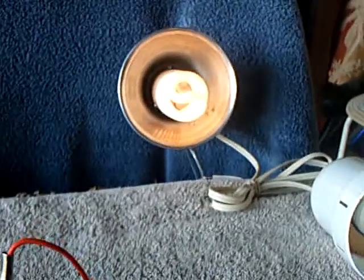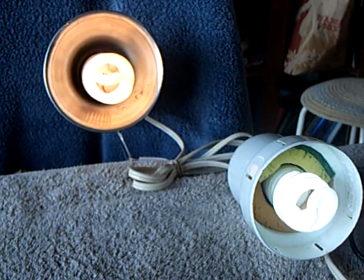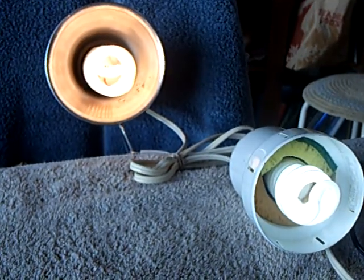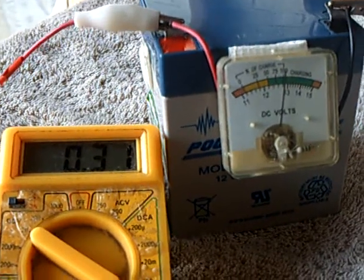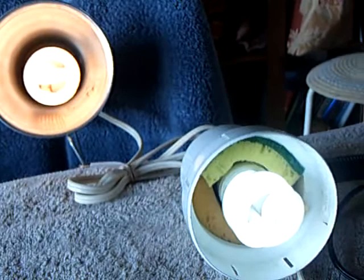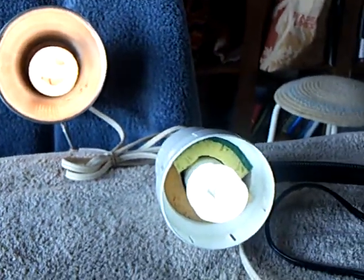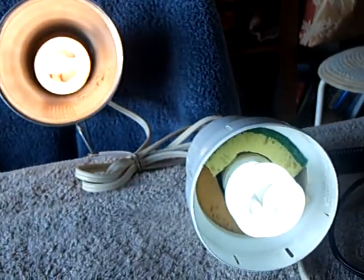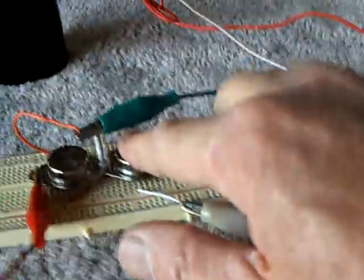I can dial this up and increase the brightness slowly — if it stops you have to jump-start it again. My target is about 300 milliamps, which is what I draw on my standard 12-volt fluorescent bulb on my boat. I'm trying to beat that light — if I can get more lumens out of the same power, I've got something better. It was drawing about 320 milliamps at 12 volts. Right now it's running two bulbs, each about as bright as the one bulb was on the boat. I can also touch everything now and not get shocked.